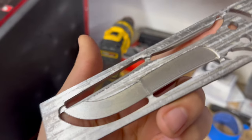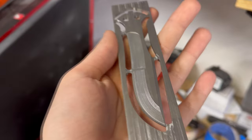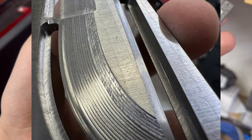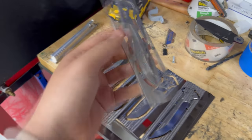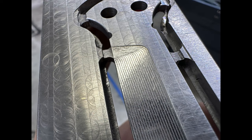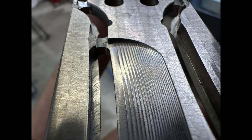Okay, so I'm a little more than halfway through all my Op 2s and I wanted to quickly mention how tool wear manifests, specifically on the bevels. You see this one side — this was cut with a fresh tool, one of the first blades cut — and it has a really nice bubble finish. You flip it over and you'll see a big nasty burr and the bevels aren't quite as nice. I do have a picture of this side by side and I'll insert that here. Just got all the Op 2s done — they're all looking pretty nice. That is gonna be it for this video. I'm gonna throw some pictures of them up at the end. Thank you guys for watching.